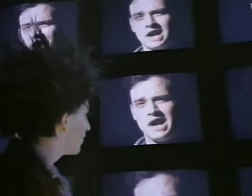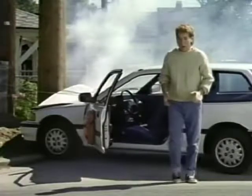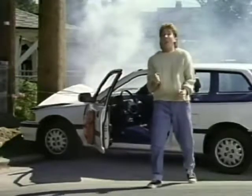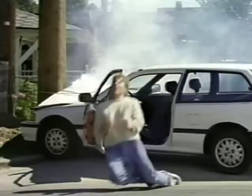Forgot that the ground was hot and that voltage diminishes in concentric circles like ripples in a pond. Forgot that he was stepping into a lower voltage than what was under his back foot. Forgot to hop or shuffle with his feet together.